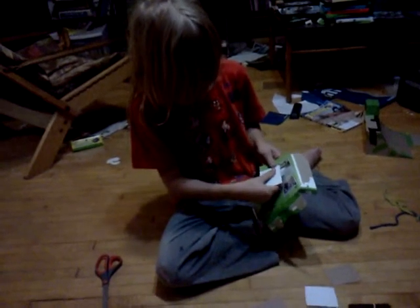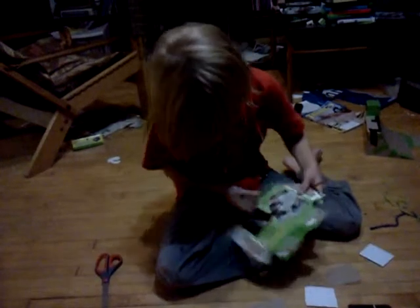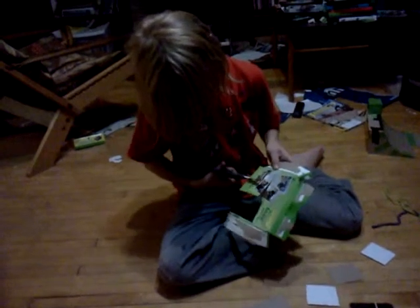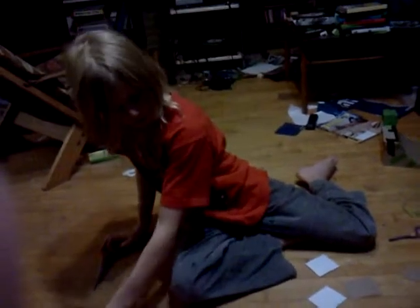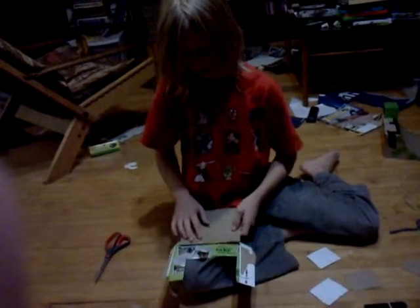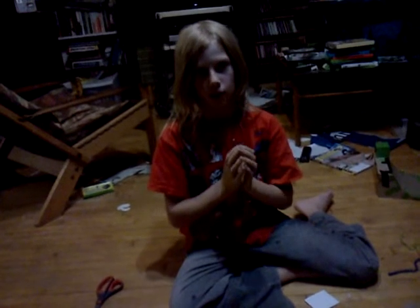See how I got a mark for how far over it goes — that way you can see you don't want to overlap it and you don't want to make it too short. Cut that out. Always keep these pieces separate in different piles so that you know which ones go where. And then here is your top deck, just like that. You're essentially going to do the same with this part here — do the length, do it where it ends and how far your board goes in. That's it for the pieces. I'll be back with part two on how to assemble your ramp and part three on how to put the extension on.